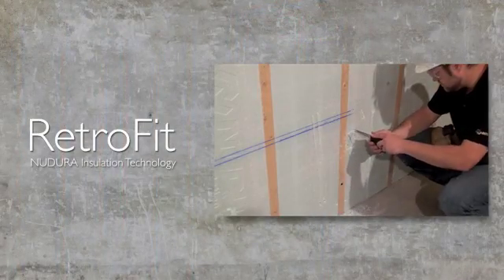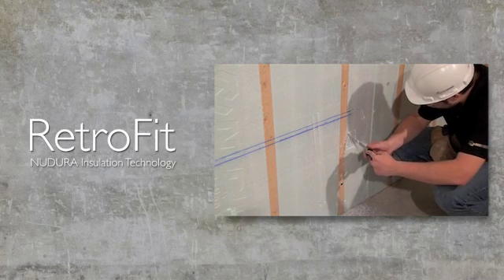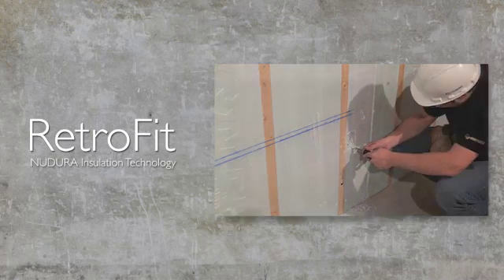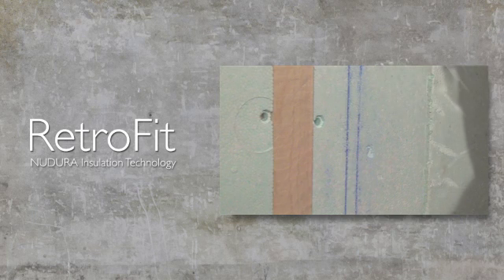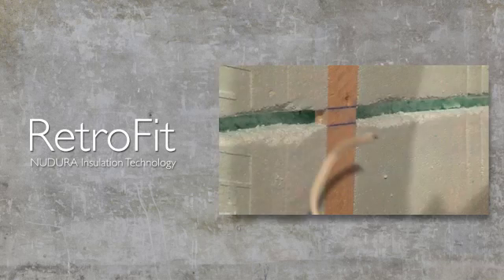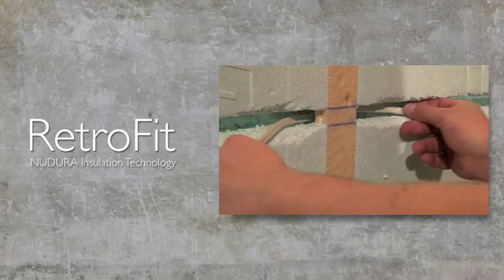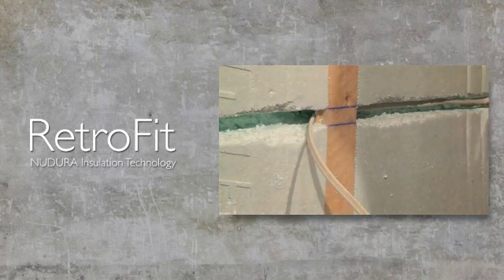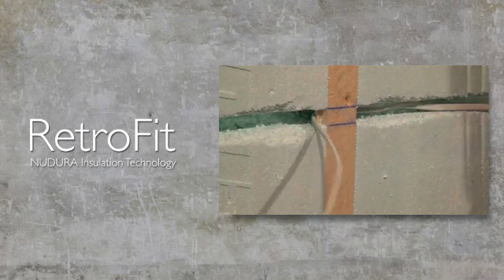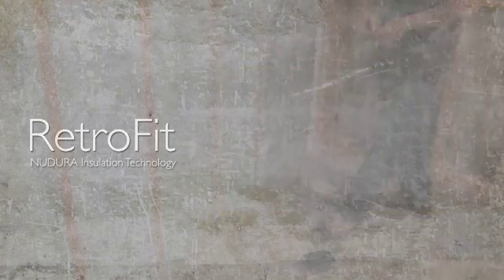To install electrical wiring, there are a variety of methods that can be used to cut wire chases into the foam: a hot knife sized to cut a 3/8 inch or 10 millimeter wide cut, a router, or a utility knife as shown here. One important note: for ease of work, do not cut through the wood fastening strips. The wiring can easily be fed behind the fastening strip by simply removing the EPS foam, as will be shown later on in this segment.